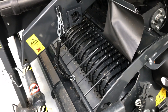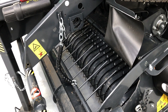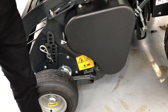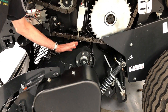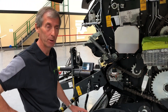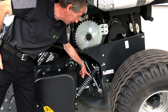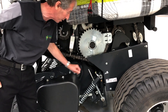This pickup reel has longer tines and narrow gaps between the strippers for good cleaning in wet crop conditions, plus an innovative keyhole system fitting for the pickup wheels. The pickup is pivoted about the centerline of the rotor so that when we lift on headlands or across swaths, we have 30 centimeters of clearance under the wheel — very big ground clearance so you don't take crop when traveling across a headland. Pickup flotation with springs over the cylinders gives good flotation, easily adjustable by moving the collar up and down in these grooves, although normally it wouldn't need to be changed.